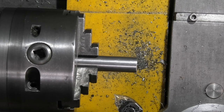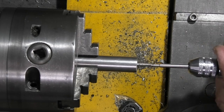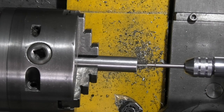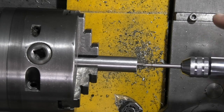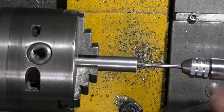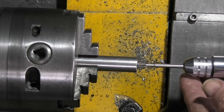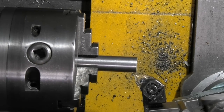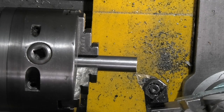Bottom in tap, just follow that down till it locks and come out. I'll set my compound slide to 15 degrees and now I'm going to turn a taper on there.